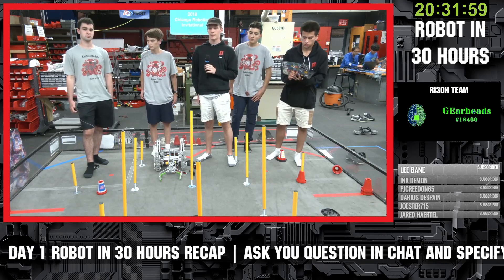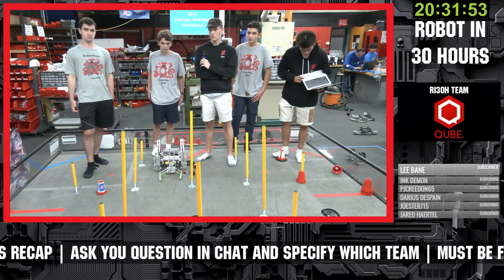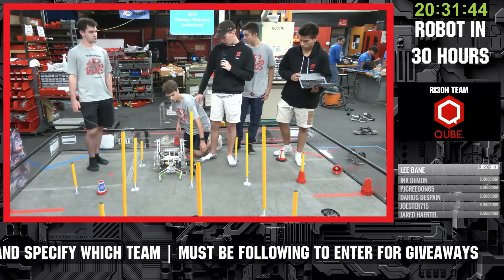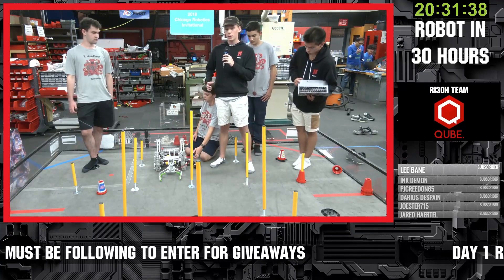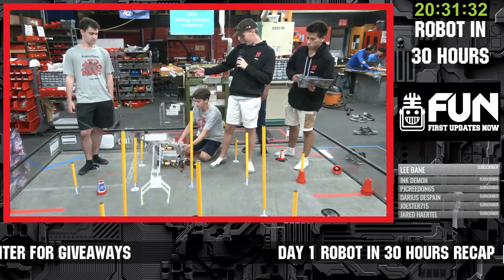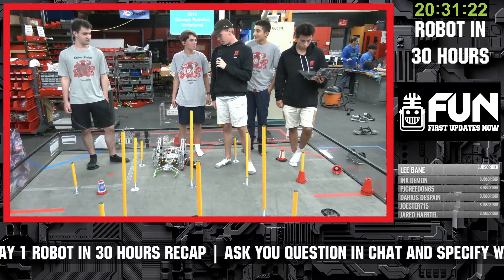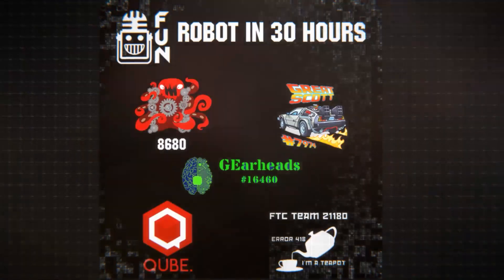What's left to do on your robot and where do you plan on being in the morning? One thing we've noticed when extending and testing is that there's a lot of force behind it, so adding weight to the bottom by the drivetrain - or maybe even making the drivetrain 16 by 16 - is something we've talked about, since those are CNC plates. This was actually the first time we tested it with the claw, so we definitely have to add weight to it - safety first. Adding stuff to the bottom or making a bigger base is going to be a big thing going forward.